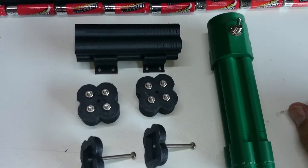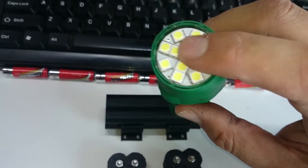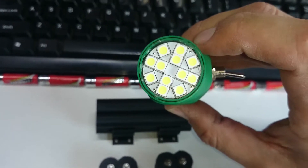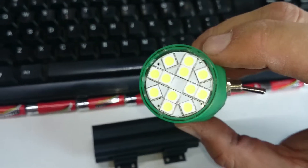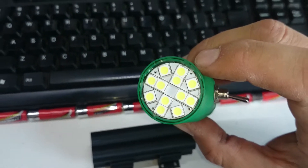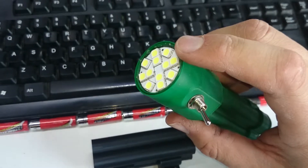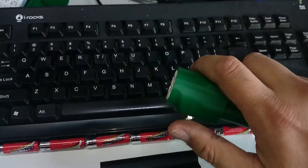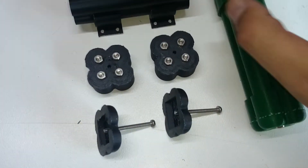This can be set up in two configurations. You can make an LED torch by using one of these LED modules, available from a Jaycar dealer for about $10, or from the link on my Thingiverse site through AliExpress for about $0.80. They have a built-in regulator that helps step the voltage up as the batteries go flat, and they're exceptionally bright — not great for distance, but ideal as a flood light, which is what I use when I'm under car dashboards.